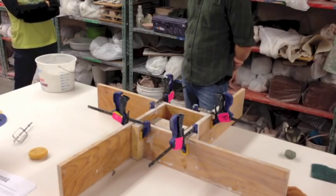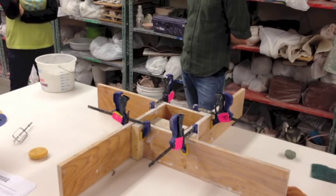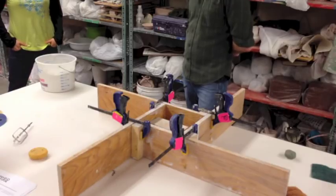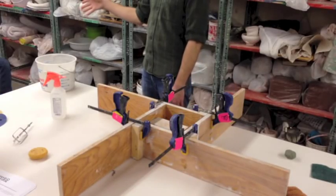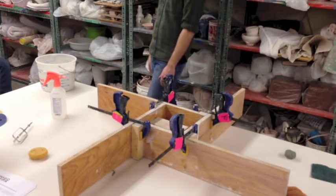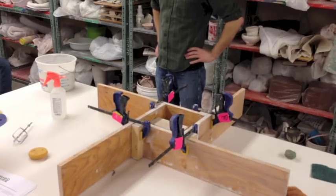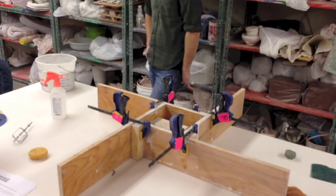Like I said, it makes it creamier - it's like not having to mix. The chemical interaction has already started, so every single plaster particle gets a chance to react. Once you start mixing it, it starts solidifying. Mika used to say that it's not worth it to make a mold unless you're going to be using it like 50 times or anything like that - it's time consuming. If you can't picture yourself repeating it 50 times, it's not worth it.